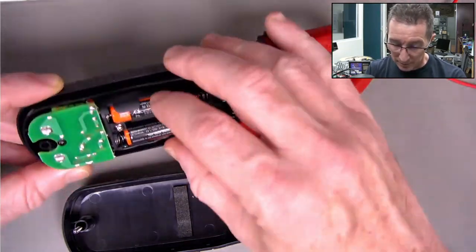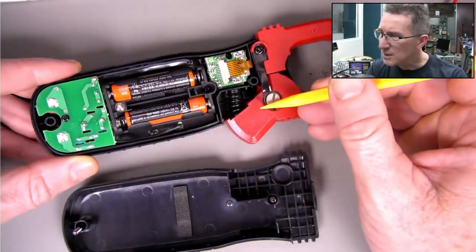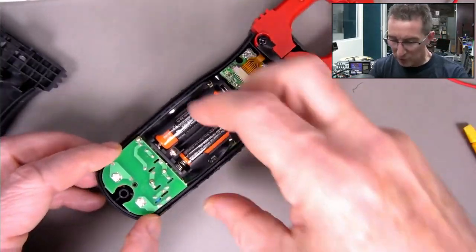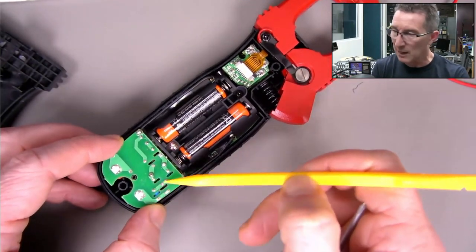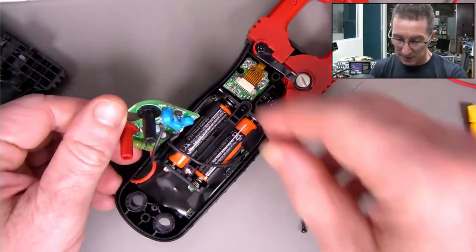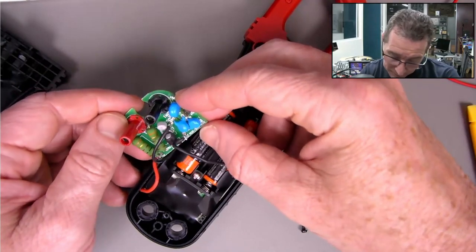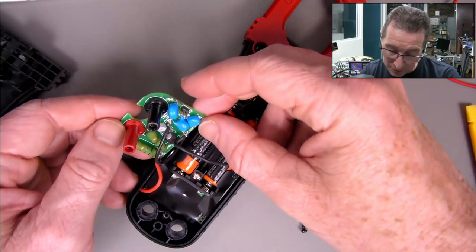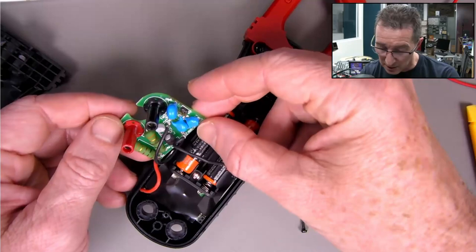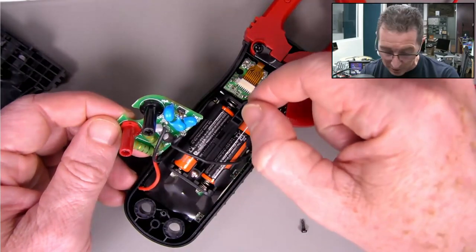There's a little battery holder in there. Some wires and a little header down there. Let's look at the input protection - it looks really good. It's on a separate board. The spacings in there and they've got isolation slots as well. It's a Brymen - three MOVs, two PTCs, and two fusible resistors. They're using a pin interface to connect down to the main board.